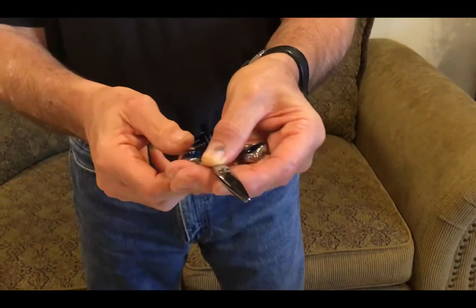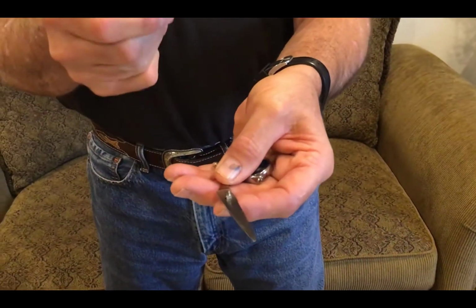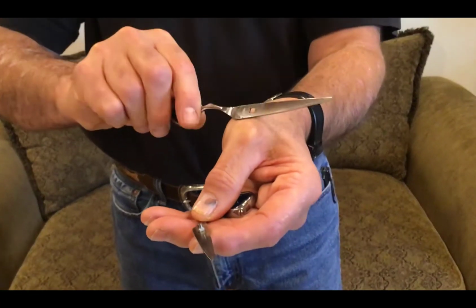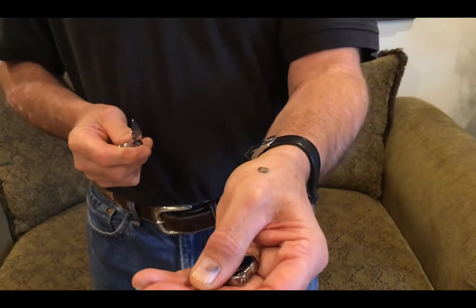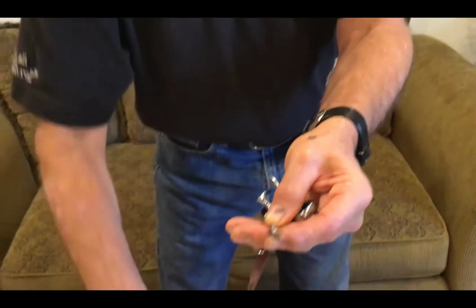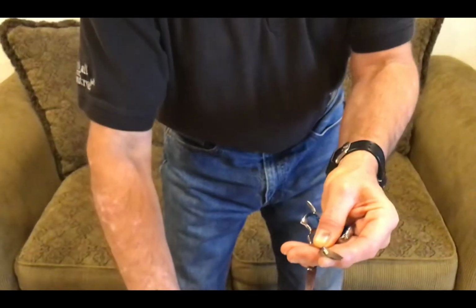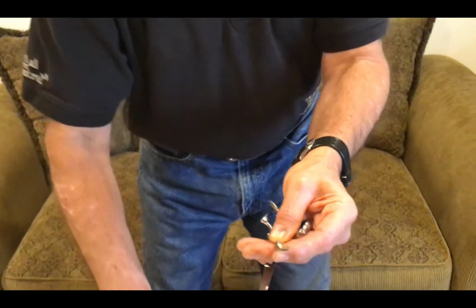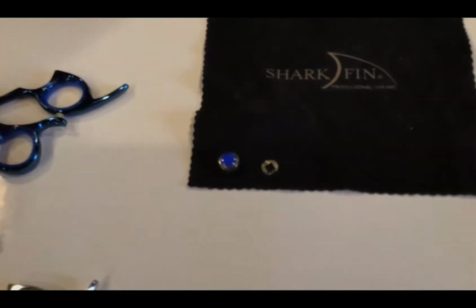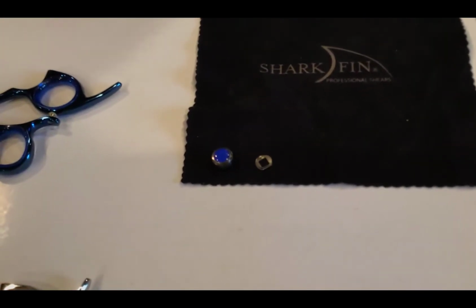So now I'm going to lift up the ring blade. Now, just for demonstration purposes, I'm going to turn it over on my hand, kind of hit it. There's the click plate. We're going to talk about that in a minute. So let's take the adjustment knob, put it here. Take the click plate, put it here. If you guys can notice on that click plate, by the way, it's square. We're going to talk about that in a second, okay? You guys can all see that it's square.